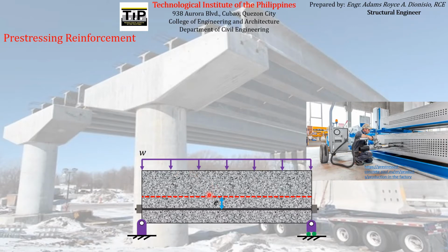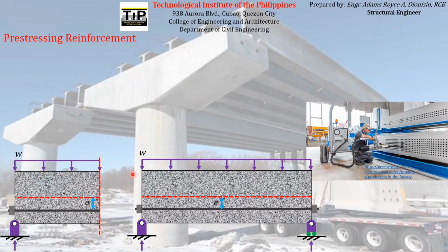If we want to investigate what is actually happening or being experienced by the pre-stressing reinforcement at this particular time, or actually at any stage of the pre-stressing activity, we just have to cut the concrete element somewhere on its length. Say for example, we cut it here, on this particular location. Since we cut it there, we can see the force acting on the pre-stressing reinforcement, which obviously must be a tension force because the pre-stressing reinforcement is in a state of elongation. And since it is still elongated, the force acting on it must be a tension force